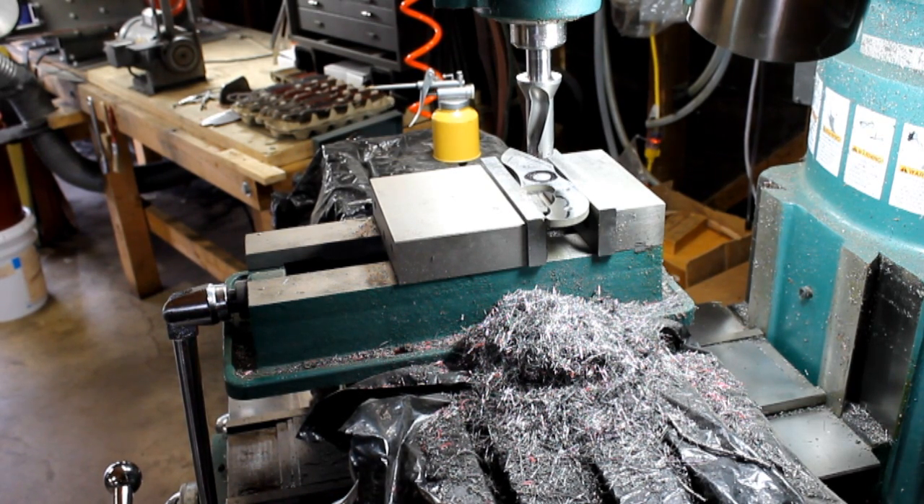The trick is to run the feed rate really slow, especially when you're using a one-inch diameter tool. These go all the way down to about half inch I believe - I just bought the one-inch. These are actually about $300 or $400 if you get a good quality one, which I would recommend. The inserts are actually expensive too, but to me it's worth it because I make a lot of silent soldiers and I use it a lot.